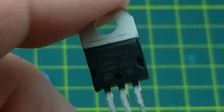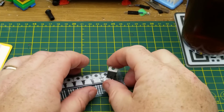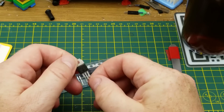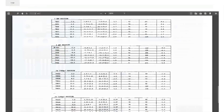7905 — that is a negative 5-volt voltage regulator. Those should be good companions to the 7805 positive 5-volt regulators that I've got. I don't do too much that needs both positive and negative rail, but being able to generate it occasionally and nice and smooth is a bonus. 10 pieces of L7905CV, LM7905 voltage regulator IC, 5 volts, 1.5 amp.